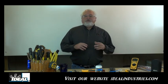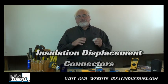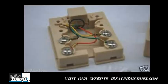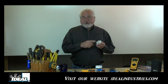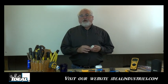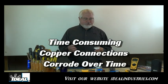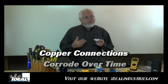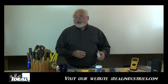The connections are called IDC type connections. Back in the day, older telephone connections were screw-type in a lot of cases, where you'd have to strip a little bit of the jacket off the conductor, wrap the conductor around a screw or a post in a telephone closet, and tighten the screw down. They also used wire wrap tools to wrap the conductor tightly around a post. That requires stripping the wire, which is time consuming, and that connection is exposed to air, so it corrodes over time. Corrosion is always a problem with those kinds of connections.